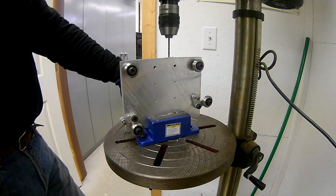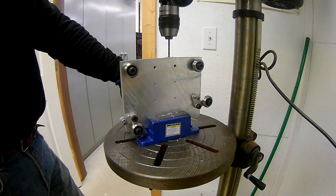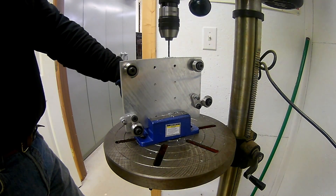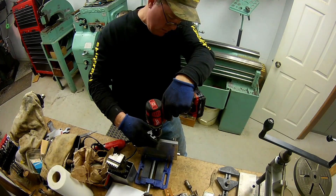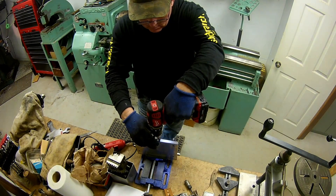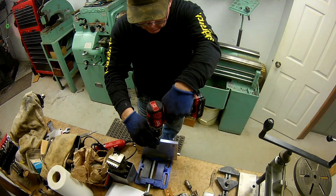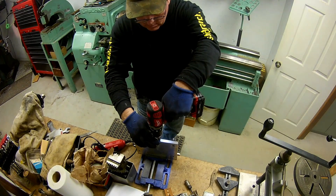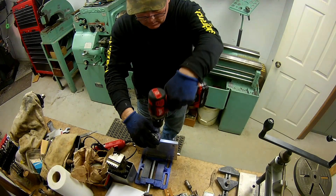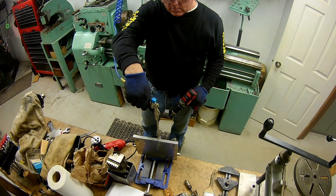So this is where I'm going to show you the third way that I do most of my tapping — it's another way that just about anybody can do, and the only thing about it is if you're going to screw up you screw up faster. Just like with hand tapping I use the guide block, a good tap, a little oil — but this time instead of putting the tap in a tap handle I put it in my cordless drill. Put it on low speed and run it in. The thing about this is you lose the tactile feel of how the chips are cutting, and backing up and breaking the chip is always to some degree important. Keeping it straight with a guide block reduces my risk of catastrophic failure.